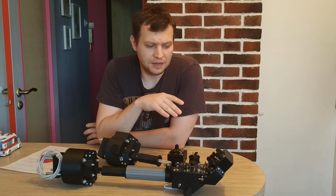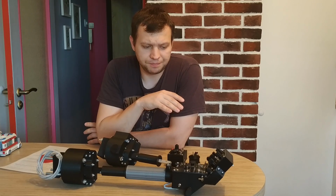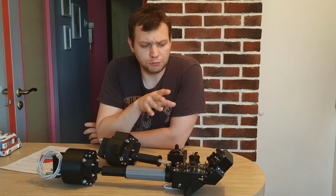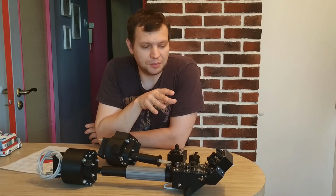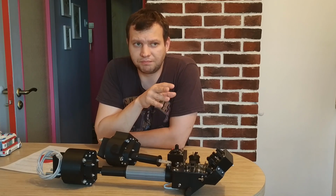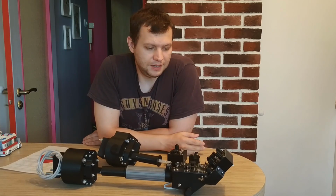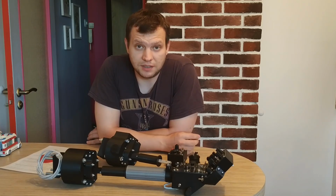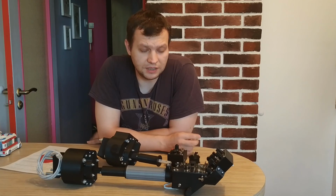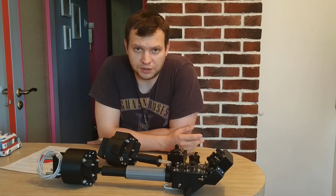But I've been searching for the best way to do it for a while, and after some trial and error and googling and other stuff, I finally found a way. We just have to use compiler directives like #if defined, and put all our devices in these if defined blocks. Then the idea of the new software is that it's even more modular, much more modular than the third generation.